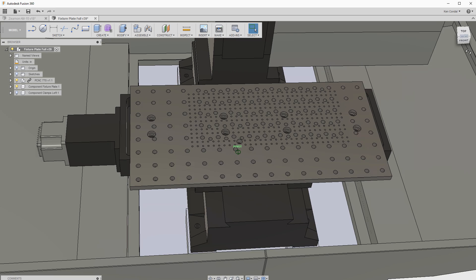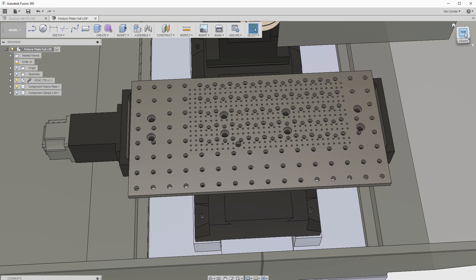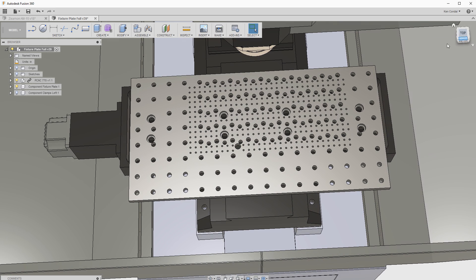The fixture plate will be connected to the T-slots with these locating holes here, which are countersunk. There are a number of 1/2-13 TPI holes throughout, and the reason I chose those is because that's the standard clamping mechanism used on this mill. I've also put in a bunch of 10-32 holes, which are the size my other mill had, because I still have clamping mechanisms that work with those. Additionally, I've added rows of drilled and reamed holes for 3/8-inch dowels, and these are going to be used for aligning things in X and Y.